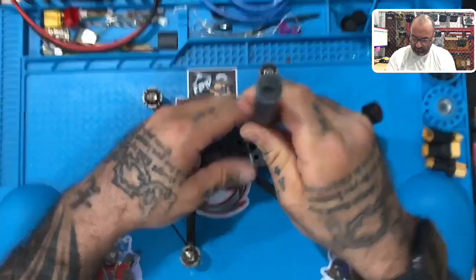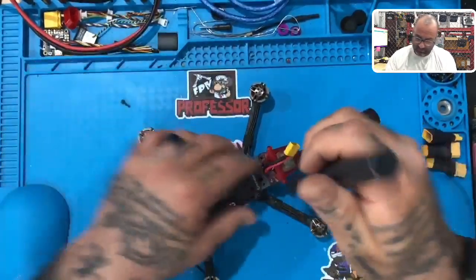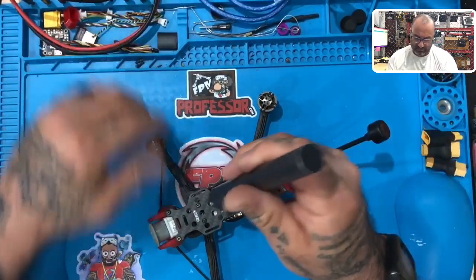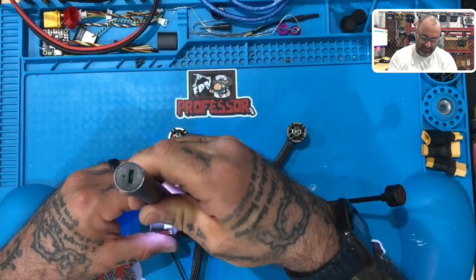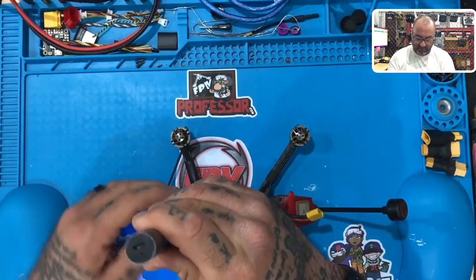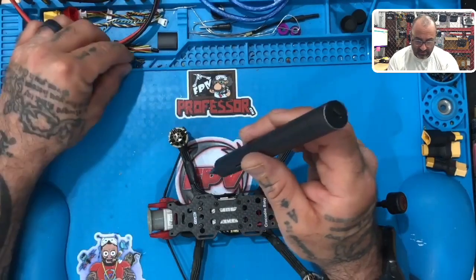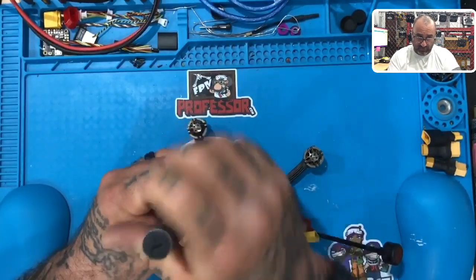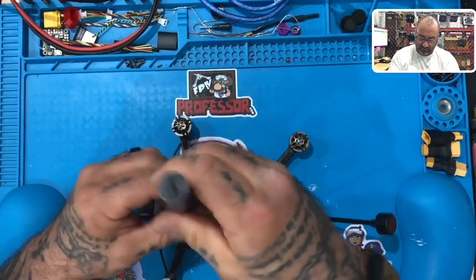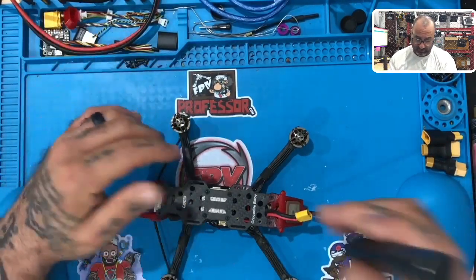John, you getting it working? It doesn't want to connect to the receiver, even though it's showing it's connected to the receiver. What receiver are you using? S-Bus. That's not a receiver. What receiver are you using? What brand? Actually, it's the one I'm watching pre-made. I don't know. You gotta help me. Is it a Free Sky? Yes. Okay, so you're running a Free Sky. And you're not seeing any feedback from the Betaflight? It's functioning through Betaflight, but it's not functioning on the drone. Say what? In other words, the motor's not powering up when I hit the throttle. Right, but do you see the stick movement in Betaflight? Yes. So when you move the radio sticks, it moves? Yes. Okay, then it's not the receiver not functioning. So first thing you want to do when you have that problem is check your sticks, make sure the stick pad. Okay, you're in, I can see your screen, you're in motors. You can't be in there.